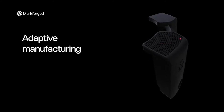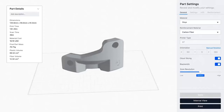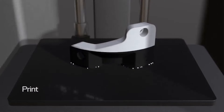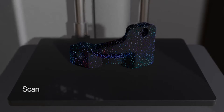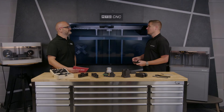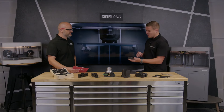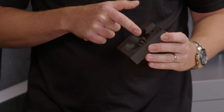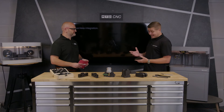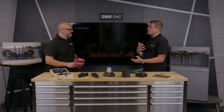Blacksmith is a bolt-on to Eiger that really opens up the technology. The X7 behind me has an inbuilt scanning system — not just bed leveling and calibrations, which are automatic, but going back to our mold tool, we want to make sure it is within tolerance. We can go straight from printer to shop floor, skipping the QA department. It will recognize where a part is out of tolerance and print more accurately next time, automatically augmenting your CAD — almost elements of machine learning.